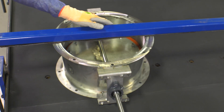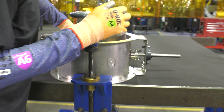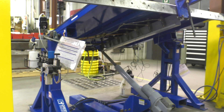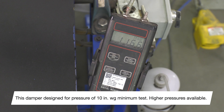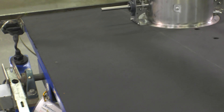To perform our testing, we attach the damper to our test table and secure it to make an airtight seal against the table. We then pressurize the damper from the side. When testing, we over-pressurize the system by a minimum of 10% to ensure a reasonable margin of safety.